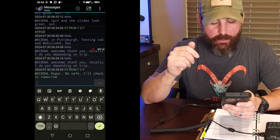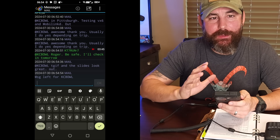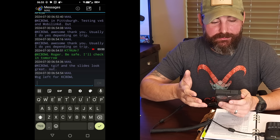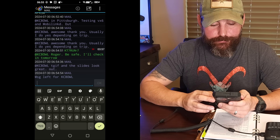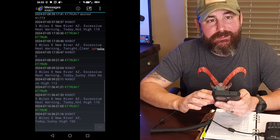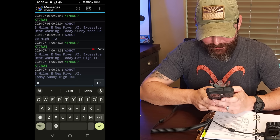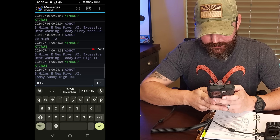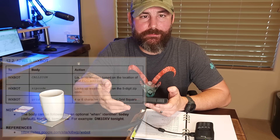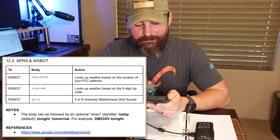We're going to wait for this to turn bright green and then go ahead and check some weather using the same application. It went bright green, so I know that when he goes to do the exact same thing using the APRS M request, he'll be able to get that message. It also looks like a couple of other messages came through from Friday — shame on me for not checking in. Next up we're going to check the local weather. There is a special SSID called WXBOT and all we have to do is craft a message to it. I'll put in my call sign — it does a reverse lookup and returns the local weather for where I have my FCC license registered. I can also put in a zip code. I've made field cards for the Buy Me A Coffee folks on some of the basics.